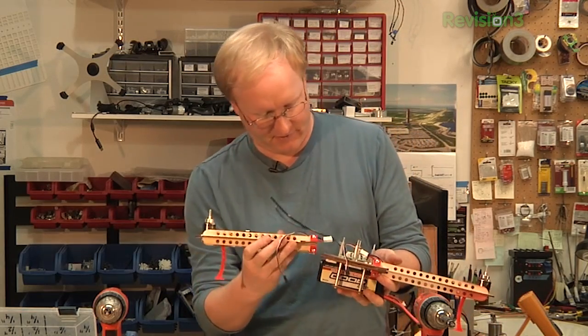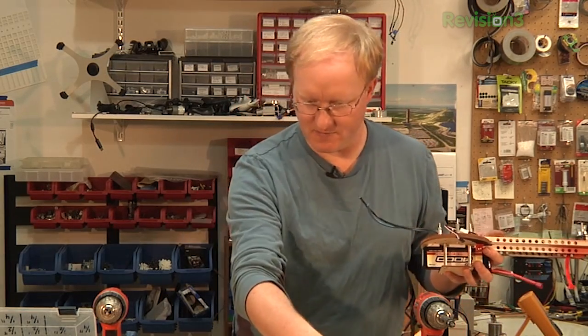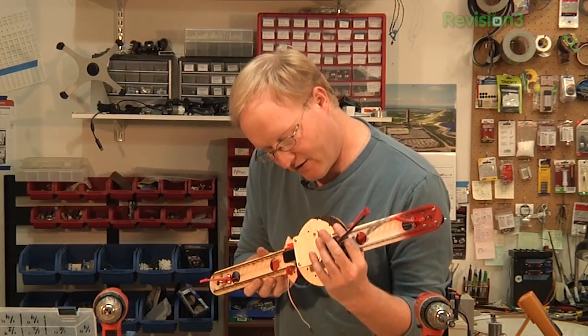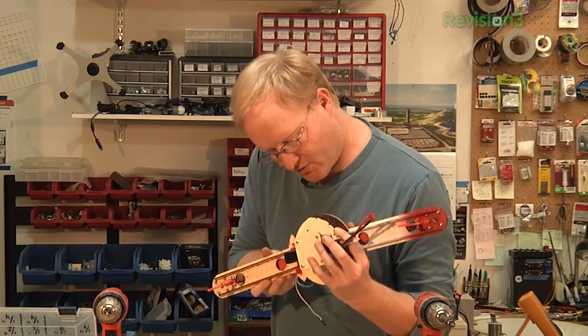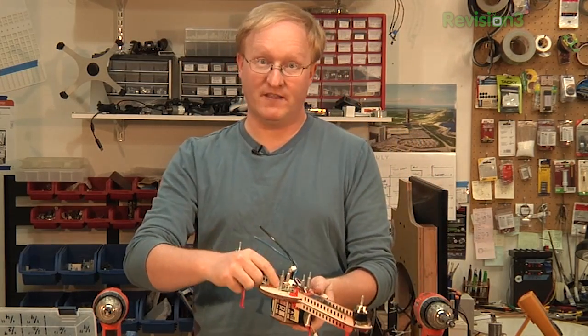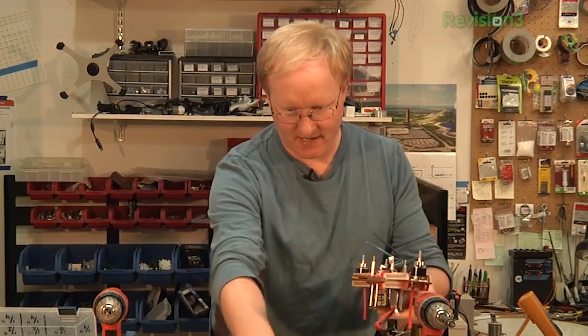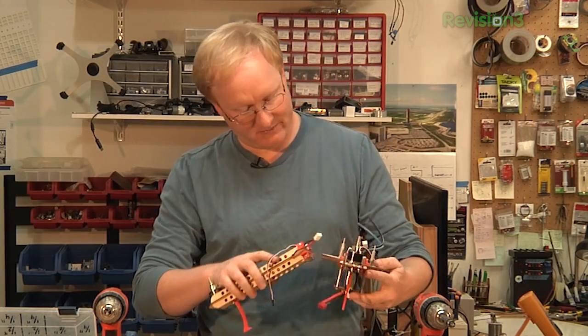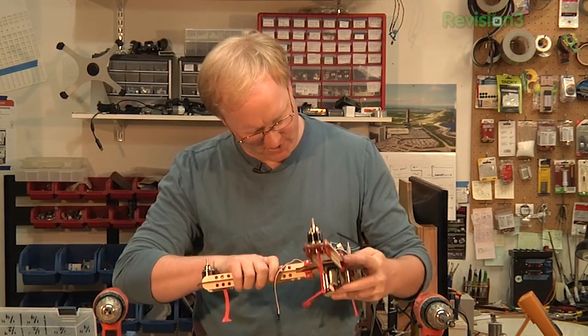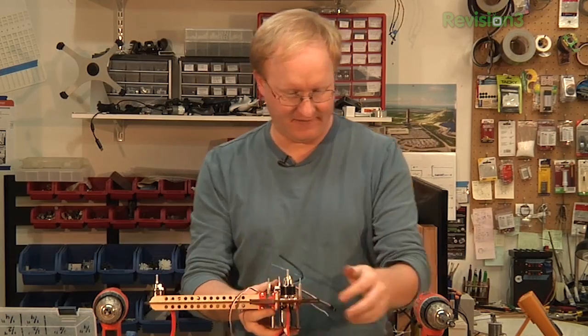Okay, let's attach the rear one. Oh wait, some of these have different bolts, so they'll straddle the battery. See how it has to straddle the battery? Use the shorter bolts for those. And remember that square that was in here originally with the captive nuts? These flat pieces bump up against that, and that's how it all lines up. So when you put it all together, it should be fairly solid.